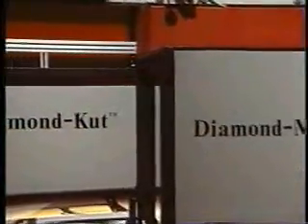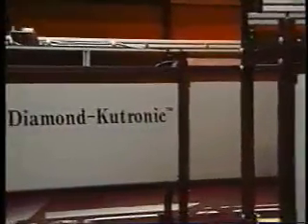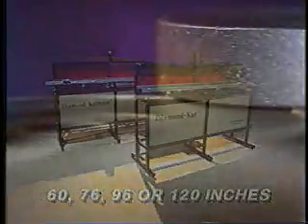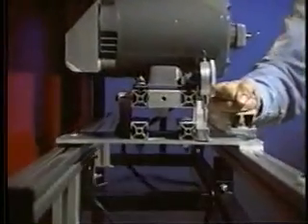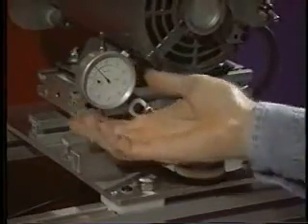To increase speed and efficiency when sharpening longer squeegees, Encore Engineering offers manual and automatic units that utilize 6-inch diamond wheels. The Diamond Cut and Diamond Cut-Tronic series are available in sizes to fit maximum squeegee lengths of 60, 76, 96, or 120 inches. These machines are supplied with both coarse and fine-grit wheels to give you production flexibility. The Diamond Cut is manually operated but retains all of Encore's precision features. The blade of the squeegee is clamped and the sharpening wheel travels along a fixed track, eliminating handle interference and improving stability during sharpening. A gauge mounted on the motor platform assures measurable and repeatable results, and a simple adjustment of the sharpening wheel alters the amount of squeegee take-off with each pass.